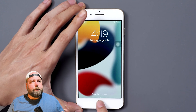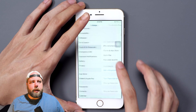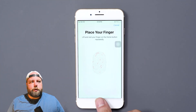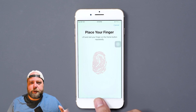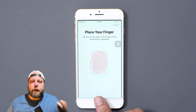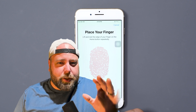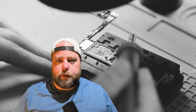Once it's fully booted up, you can actually see that the double click works and it's letting us try to get into the phone. When we go to set up a fingerprint and have it scan, it actually starts to scan. That is because the PMIC is no longer faulty and is giving power to the home button itself. And that's how this particular case — which was rare — was fixed. You can see how this application can be used across many other devices.